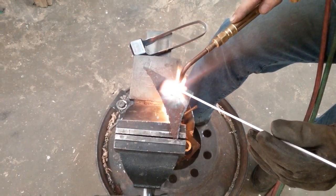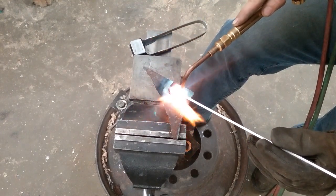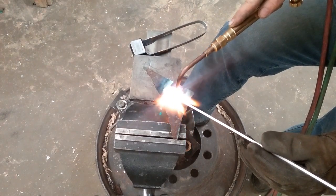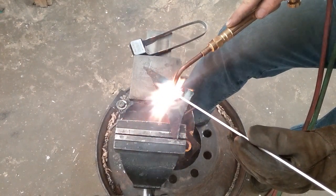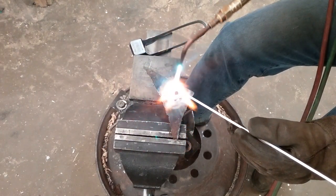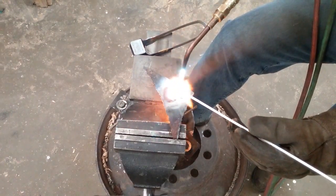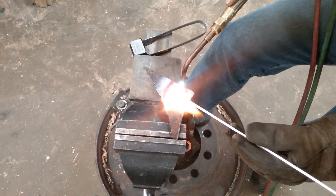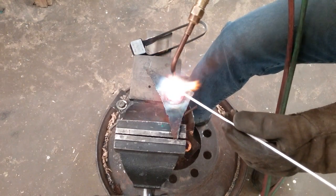The idea is just to give it a good coat of brass. If you can get to both sides of the sheet metal, that's great, but you don't have to. I often use this method on boat trailers because the lights on boat trailers are always corroded up on the grounds — there's no ground lead, just a fraying ground.